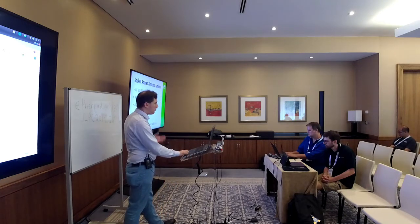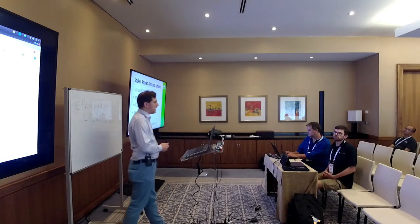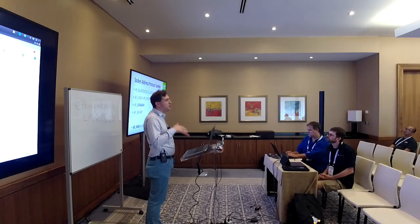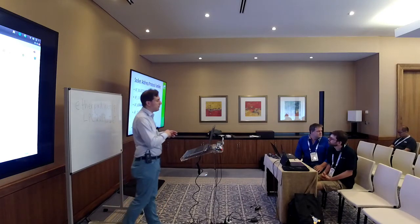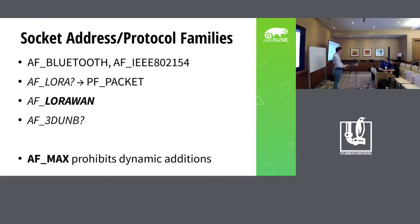Okay, yeah, so LoRaWAN is definitely something that has been in the works by another volunteer in Taiwan. It's still a bit stuck because we need something underneath to go with that, either a module driver that fully gets the implementation for LoRaWAN itself, or the soft MAC layer that would then go beneath to the actual Semtech chip layer. And again here, I also mentioned Sigfox as one technology, the UNB ultra narrowband protocol that is being mentioned here.